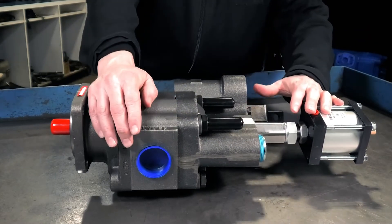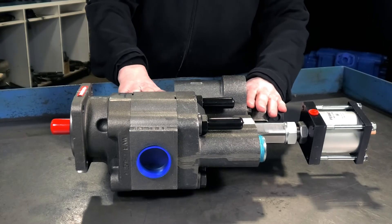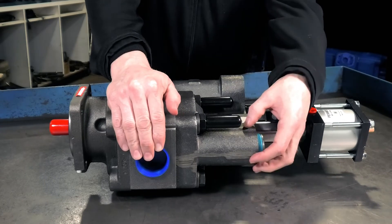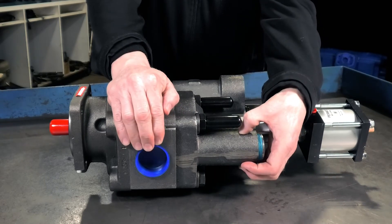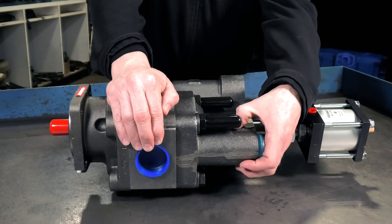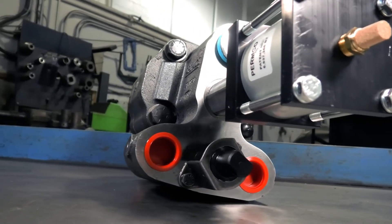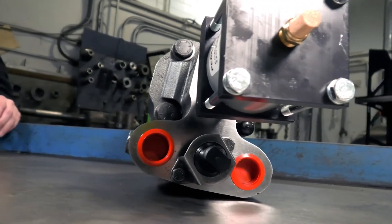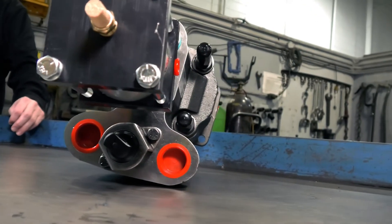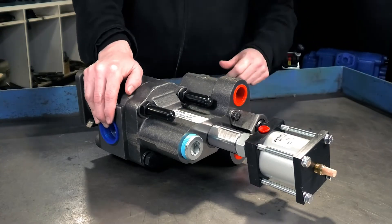In terms of plumbing, this is very much like your dump pump in terms of how it's plumbed. We have our inlet here, and inside is where the third line sleeve is to maintain our flow of oil when this is in the relief mode. Our inlet comes in, and the line at the bottom is our pressure line out to our trailer to operate our walking floor or our belt trailer. When the line comes back it goes into the return here and then back to reservoir.